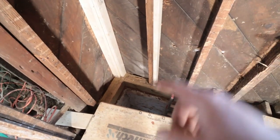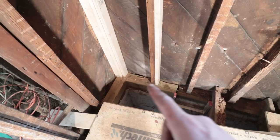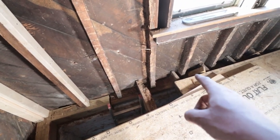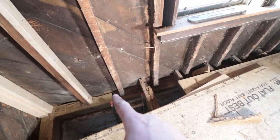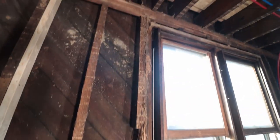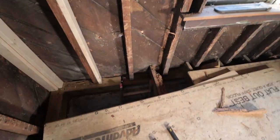So here you can see what we got done this week. We got the beam replaced in the corner here. We still have to do that section probably from about this joist over to here. Reason is here, we obviously still have rot all the way up here. Plus there's rot in the beam